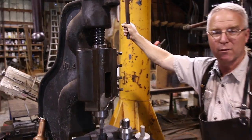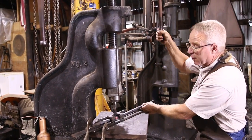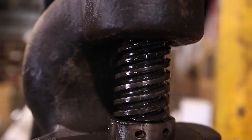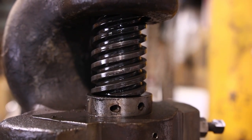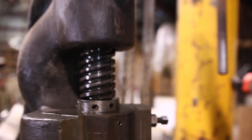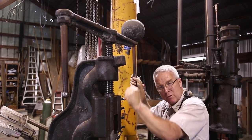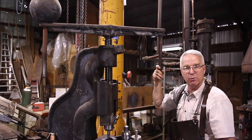This is on loan from my friend Ken Jordan, whom you'll meet again. You see these Acme-style screws? They're not exactly Acme screws because it's a triple helix — there are three separate sets of lands in this thread arrangement. I'm thinking they do that so the thrust, which is input primarily from one side and would tend to rack the shaft and cause axial misalignment, keeps the shaft centered and the thrust coming down evenly, resisting any tendency to bind so it operates smoothly.